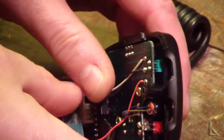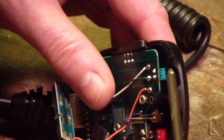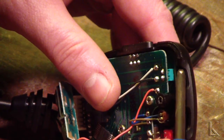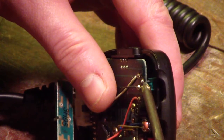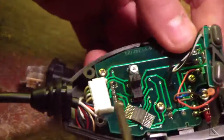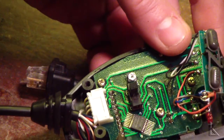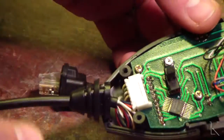Let's pull the up and down button — there we go, now you can see it. There are pins on the bottom board here and a little plastic shell that holds them and keeps them straight. The wires come right up through here. So we have to desolder those two and all of these, and then the board will come away from the bottom board.